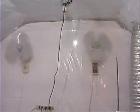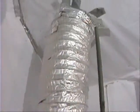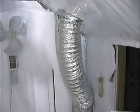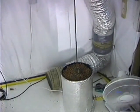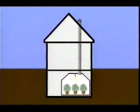At each far end, 2 fans are mounted on the wall and 3 sit on the floor, for a total of 10 fans, plus 3 more for the intake and outtake ducts. There are intakes at both ends of the room designed to direct fresh air to the floor, and a single exhaust vent in the center of the ceiling, with ducting 30 feet up to and through the roof.